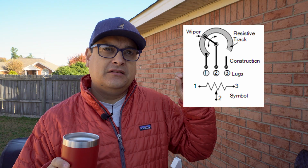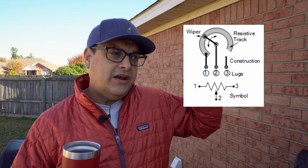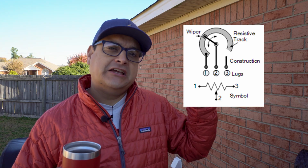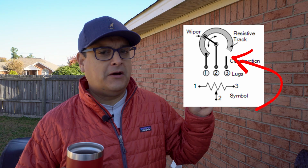So this is basically called a no load pot. And what that means is it's normal, but then right as it gets to 10, that little detent, that little hole in the bottom makes it click to 10, and there's no resistor connected right there. So you can use that on a tone pot sometimes to have it wide open, like pretend the pot's not even in there. We have another video about does a pot make a difference when it's all the way on 10, and it does.